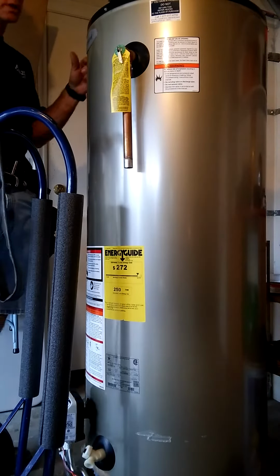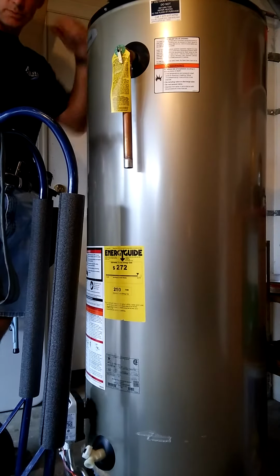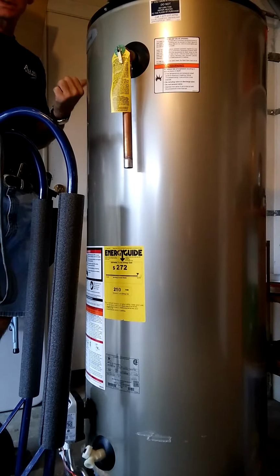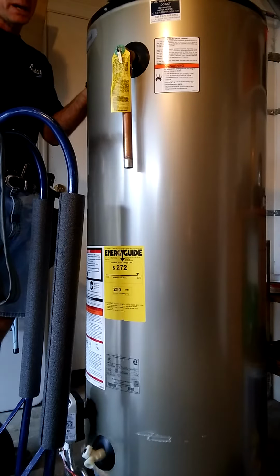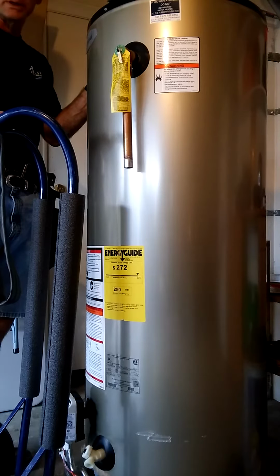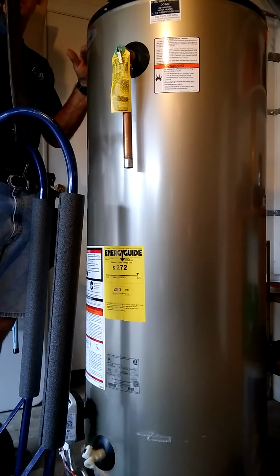Okay, so here we're starting the basic training video for putting a new, brand new customer tank, don't want to scratch it, up into a raised position. This is the same job site as the lowering video we just did. And we've got a pan in the way, as well as a pole and some shelving and some nice molding. We're just going to reverse what we pulled out. We're just going to reverse those moves with the cinch strap, the lifting strap.